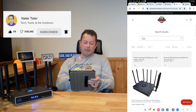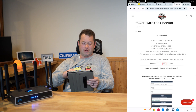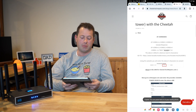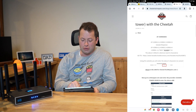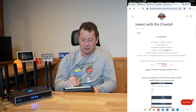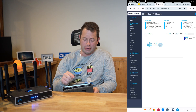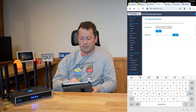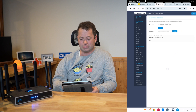You can see right there the top left is a 'tower hunting, find your tower' blog. In here it looks maybe a little daunting at first but it's actually very straightforward. I'm going to copy this top line to put into a command to the actual gateway. Looking down at the sample response, it shows we need to take the first five letters of the third or fourth entry there. So let's go over to AT commands and paste that command from the blog and hit enter — it's going to take a second to respond.